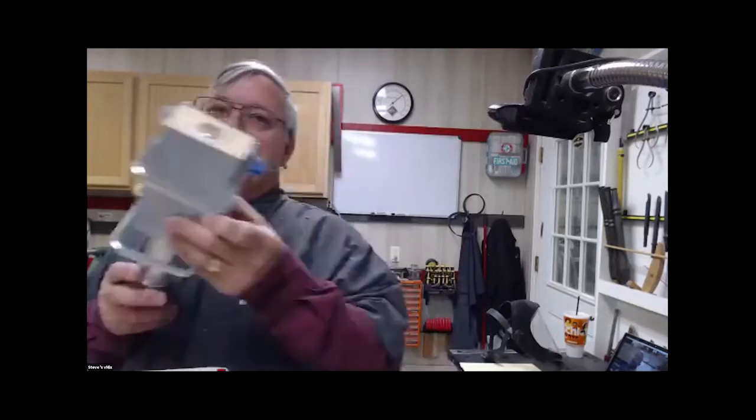Great. What's the length of the board again? 1 foot. I cut them into inch boards. I make them 1 foot long, just under 3 inches wide. The reason I started making them 3 inches wide, but just under that, is because the U-bolts are 3 inches, and if you make them 3 inches, they're an awfully tight fit. So I like just a little bit looser than that. I make them 2 7/8 generally.